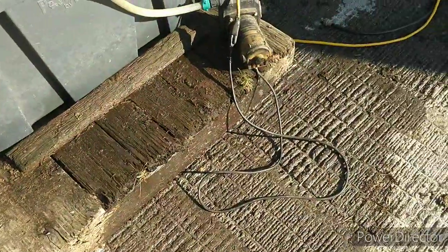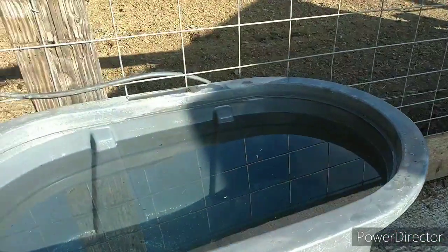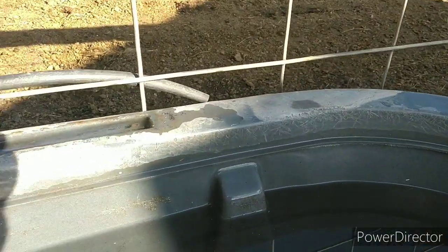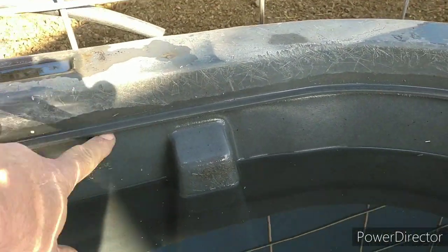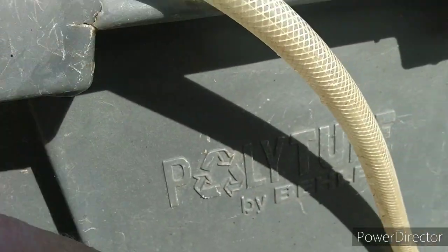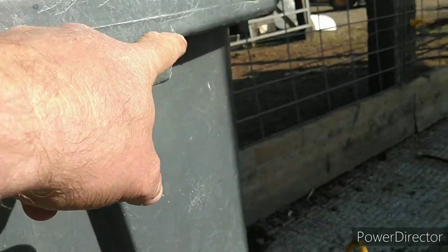The float on this trough was only good so low, the way they're made. But the water level was up into this piece, and these stupid things — it's not sealed around here. It's a little cracky here, that's full of water, just sitting there running out. There's a crack here too, and another one there. So water's just running everywhere.